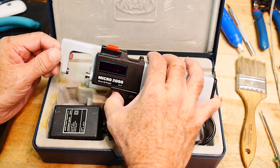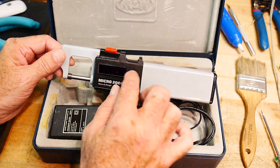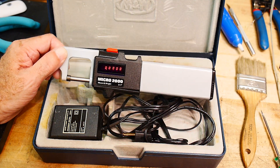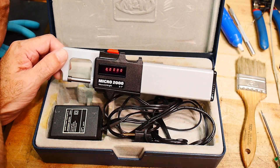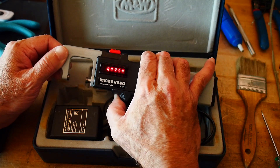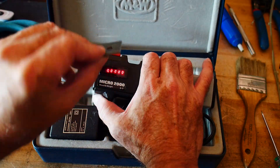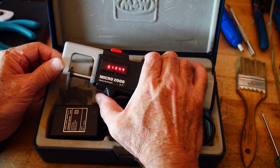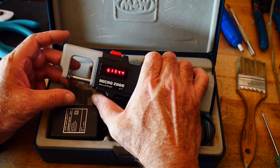It's a 0 to 1 inch digital caliper and it's really cool because it has the display like an old calculator display — like an HP 35 calculator display. Let me turn the room lights off so you can get a better look at it. As you pull back on the thing, it opens and closes. Here's a test block. It's supposed to be 0.104, and it's reading 0.1044, 0.1045, 0.1044, 0.1044.